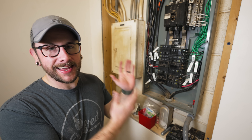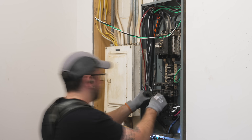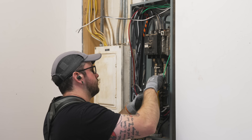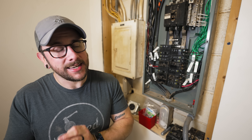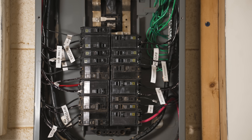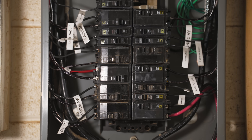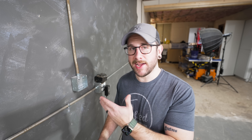Once all those wires were run I could go ahead and land them all back in the panel. One thing I did have to do with the MC cable was black out all of the white neutral insulation, because with these 240 volt circuits those white neutral wires are going to be used as one of the hots. The inspector passed that with no problem at the old shop, though it might vary in your area. I also used my label maker to label all of those incoming wires, which get confusing in a hurry, and this really helps when testing everything and when going to label the faceplate of the panel with all of the circuits.